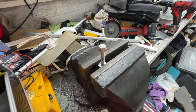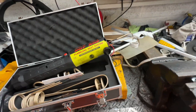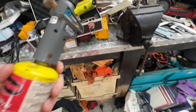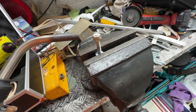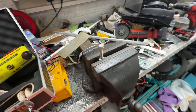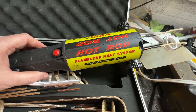So that took that 13mm nut less than a minute to go bright red. The good thing about one of these compared to your standard gas gun is you can be a lot more precise — with the coil, only everything actually inside the coil is going to get hot. Whereas with a flame, it goes past and sets things on fire. So there's much less chance of setting everything on fire if you use one of these. They are called Hot Rod — yes, that is funny.